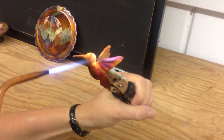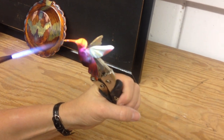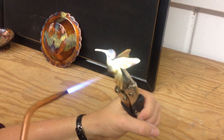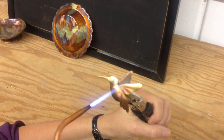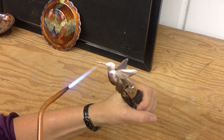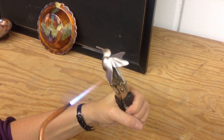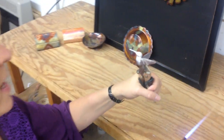For the first step of the procedure I'm going to take it right past all the pretty colors and on up to a steel gray, which is the very thickest oxidation that I can possibly get on the metal. The reason I'm doing this is to create a good background for my shapes and patterns. We find that when we start from this very thickest oxidation we get a choice of about 14 different colors in our palette.